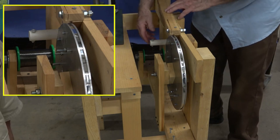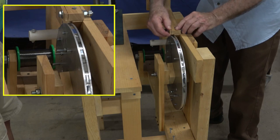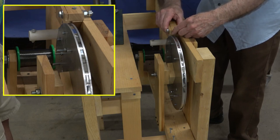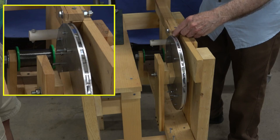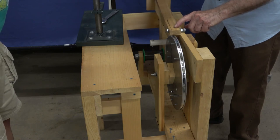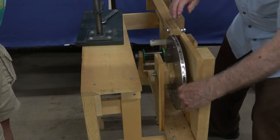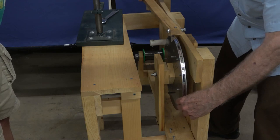You feed the wire from there through the bottom of this slot right here, over this bolt, and then you can tighten these up so it squeezes on the wire, so you get exact control of the wire as it comes out the edge here. Then you can steer where that wire goes across this by the long handle out here, which pivots about this area. Lots of motion here gives you a little motion there. That's where you control it as you're watching, as you're turning the mandrel and feeding the wire on.